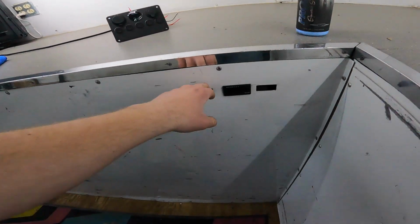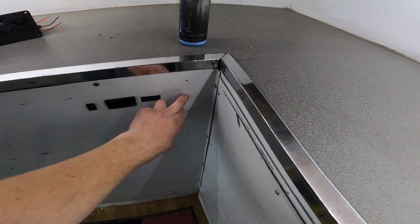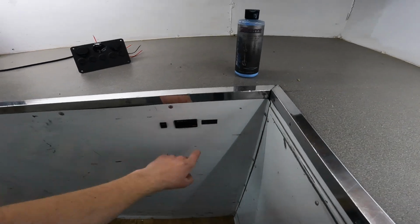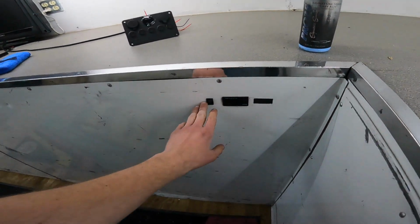Or does the main control panel for the diesel generator, like water temp, oil pressure, RPM, which really doesn't matter on a generator, so I might not do RPM. I'll do RPM one time just to get it at 60 hertz on the generator head, so I know what it's set at, because David tinkered with the throttle screw. David. So all of this right here is obsolete.